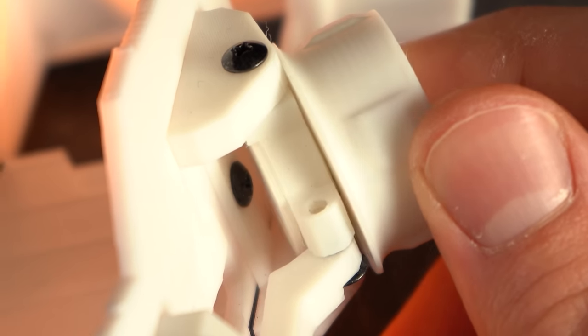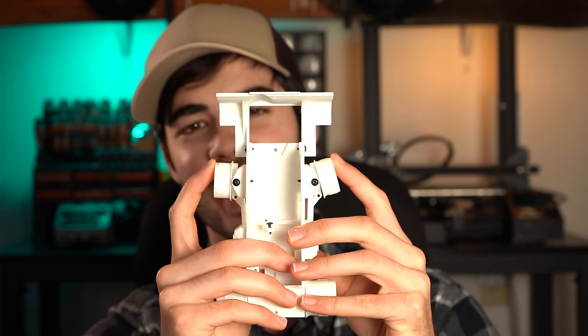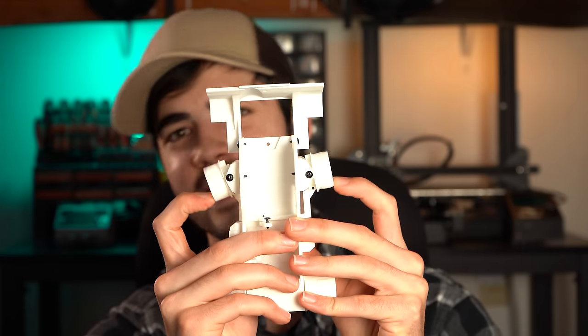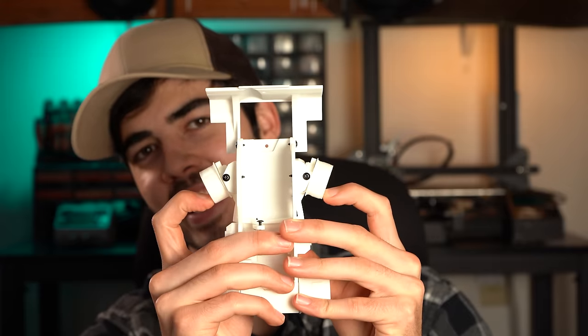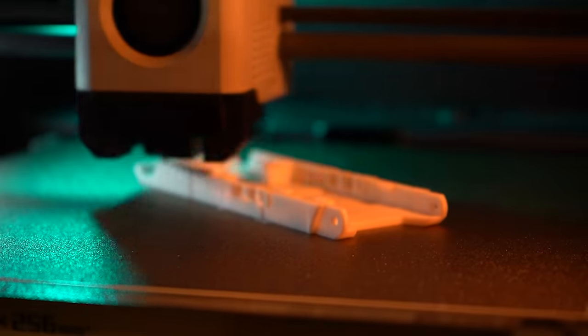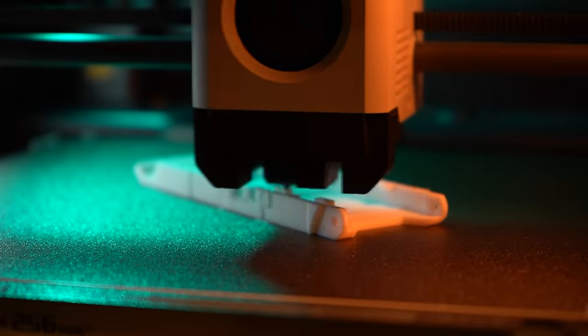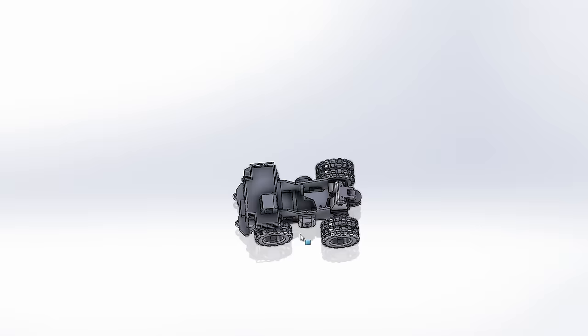While I wait for the updated printed circuit board, I'm going to try tackling the steering linkage one last time. The gap between the steering knuckle and hub is just a little too large, causing the wheel to wobble back and forth. The steering bar itself has way too much play in it — I'm barely applying any pressure and I'm able to bend it, which is not supposed to happen. Just make sure when you go to print these parts that your bed is set to the perfect height, as any compressed first layer could potentially cause rubbing issues since the tolerances are really small.